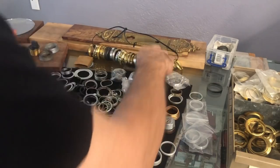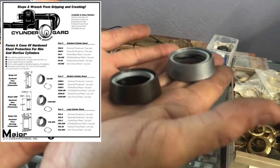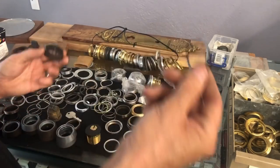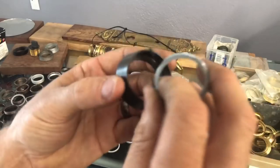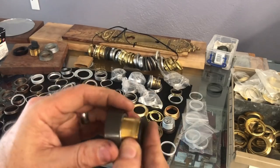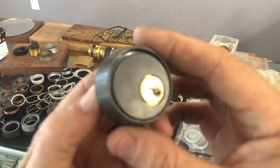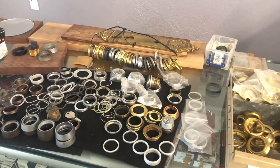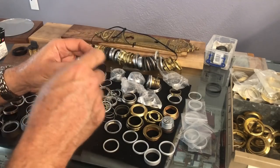On the topic of security rings, we have two or three different manufacturers. This one is Major — they come in chrome and dark bronze, in a five pack or individually. They come with what's called a wave washer and a steel blocking ring. What the wave ring does is allow an adjustable type mechanism so that it will fit some cylinders better than others. The 10B finish matchup here is a lot better than the standard ILCO spacers — not ideal, not great, but way better. Having that adjustable little ring in there definitely helps with the gap.